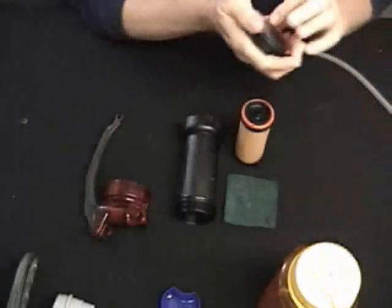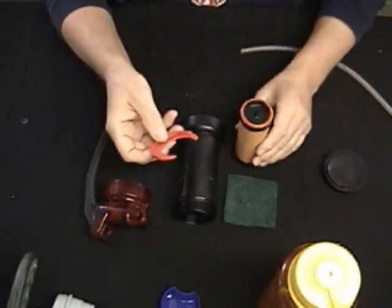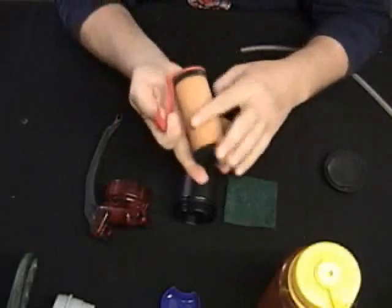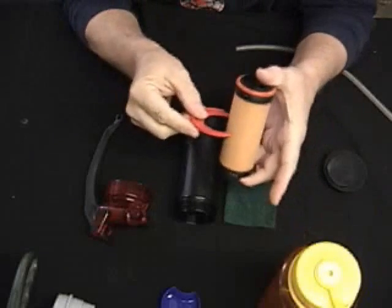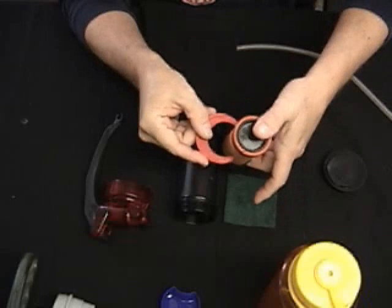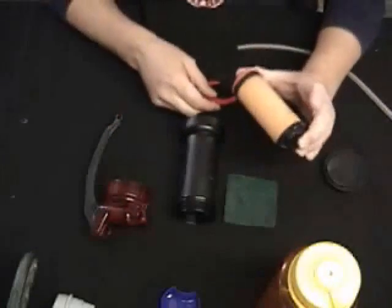You can do this like 25 to 50 times. What comes right with the filter is this rig on the clean cap on the bottom. It's designed to check to see if your filter is getting too thin. You'd probably notice it just by looking at it — you'd see it's not a nice straight edge anymore and it's starting to get bellied out in the middle. But by using this gauge, when it snaps over the filter, the filter is ready to be replaced. This one has got a long ways to go — it can probably be cleaned another 20 to 25 times easily.